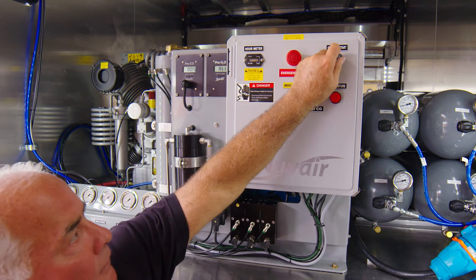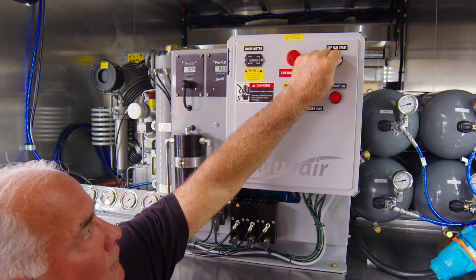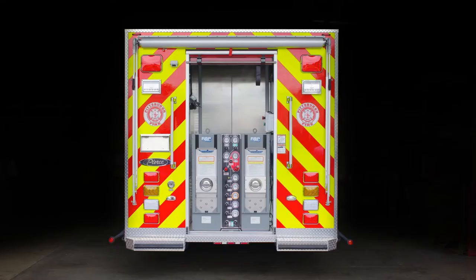Next, turn the start switch and release as soon as it starts. Before filling SCBA cylinders, you must apply air to the fill station regulator. This is done using one of the following methods: opening a cascading bank, or opening any bank and a booster pump valve, or a direct feed from the compressor. In this demonstration, we will utilize one of two Space Saver SCBA fill stations installed at the rear of the vehicle.